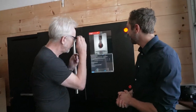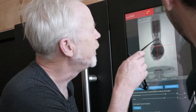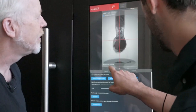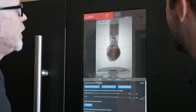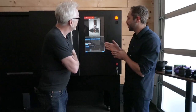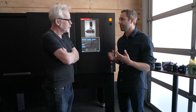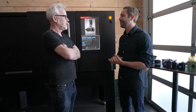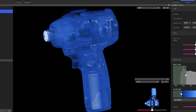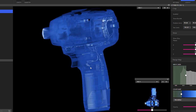We're looking at the inside of this drill — battery and contacts going over to the switch, electronics going over to the motor, and you can see the windings. I can give the turntable a 90-degree rotation and generate a new image to see it from the side. When we're looking at these two scans, we're not looking at the output of this machine — we're just looking at the building blocks. What we call two radiographs, or projections. During a scan we might take 900 projections, 1,200, even 2,000. That information goes up to the cloud, and the reconstruction algorithm figures out what that 3D volume must have been to produce those images — that inverse calculation gives us the full 3D volume of the part.